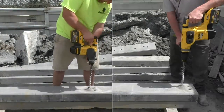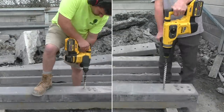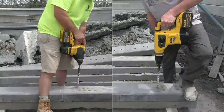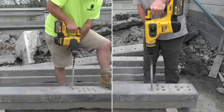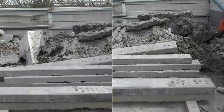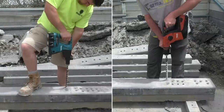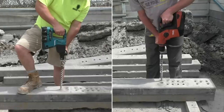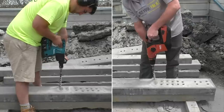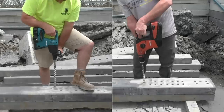Alright, so this is our runtime test. Same thing — 40MPa sleepers stacked on top. There's no particular order, but what we did was try to be realistic about test timing: we did 10 holes, gave a bit of a break, then jumped onto the next one. Interestingly, we both happened to pick up the DeWalt first and they finished the same — same time. So the big DeWalt and the little DeWalt with 22mm bits gave us identical numbers. You'll notice the Hilti is actually creaming the Makita, which is a bit unfair on the Makita since we've got two cameras running.